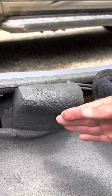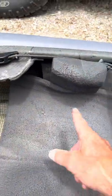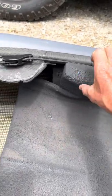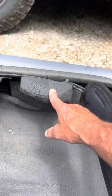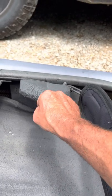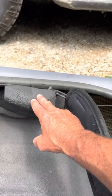We'll machine the hip pads to have a perfect angle. Unlike thermoformed hip pads found in plastic boats, thermoforming limits how much hook you can create — cloth-covered thermoformed hip pads don't have enough hook to really lock you in. So we're going to machine ours and provide the right amount of hook to give you a really secure feel.